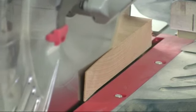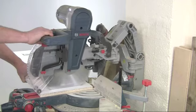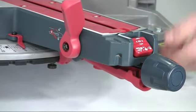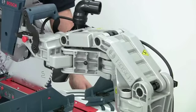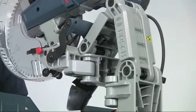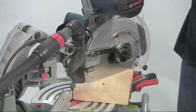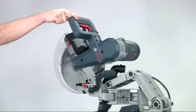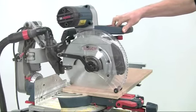It combines precision, capacity, space saving, upfront controls and a highly visible cut. The axial glide mechanism is a clever arrangement of two robust cast aluminium arms supported on 12 sealed ball races to produce a super smooth cutting action and effortless movement — hence the term glide. Just the lightest of touch is needed to move the saw head, it's so easy.